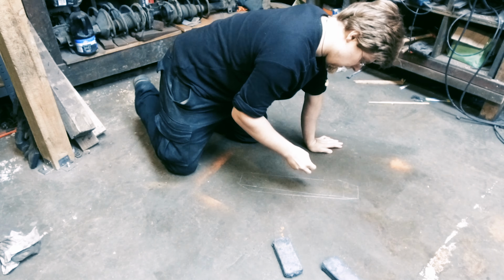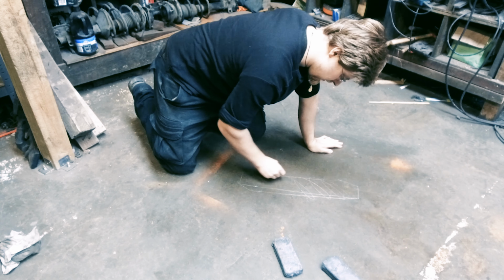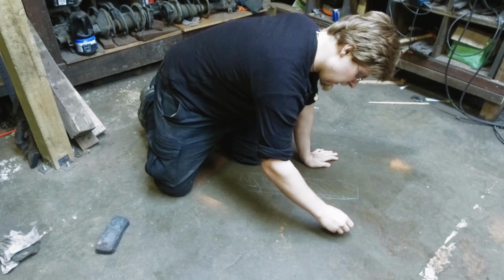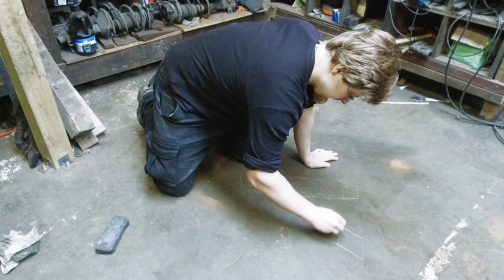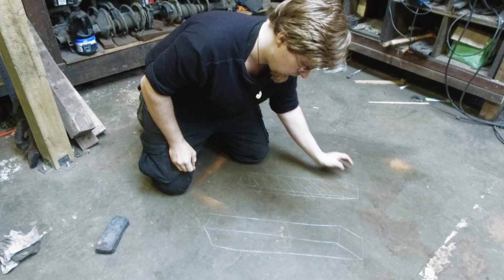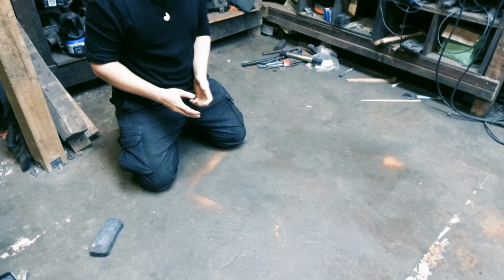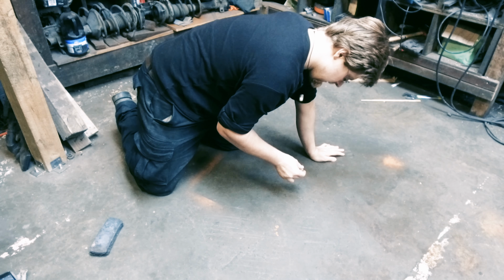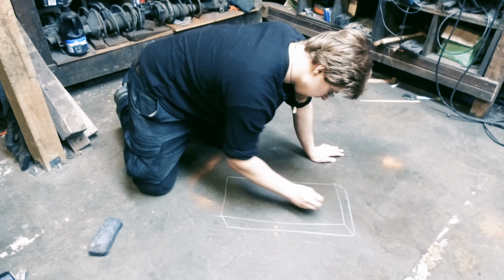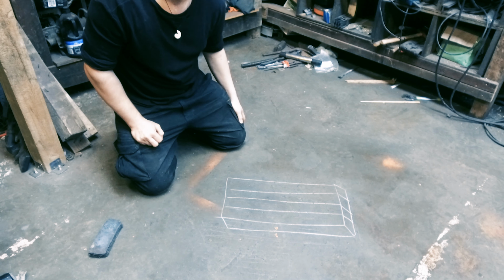The first two bars are going to have a twisted pattern in them, so the steel will be doing this, and then the other two bars are going to be a bit more simple, and they're going to have a straight grained profile, so the layers will be going this way on the end grain. Once I've got those pieces of steel made up, I'm going to stack them all together. I'm just going to draw it for you. Kind of like that, a gridded stack.